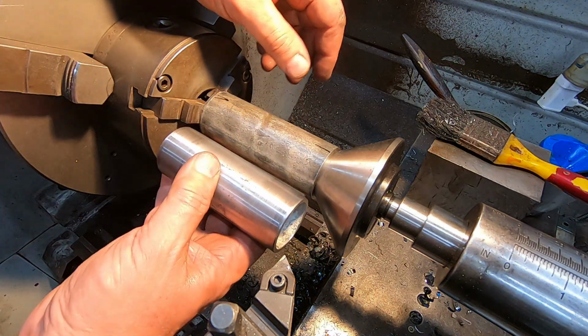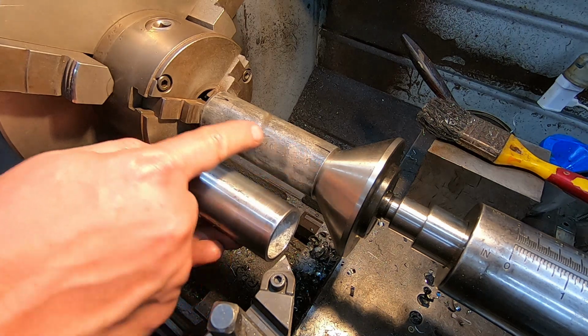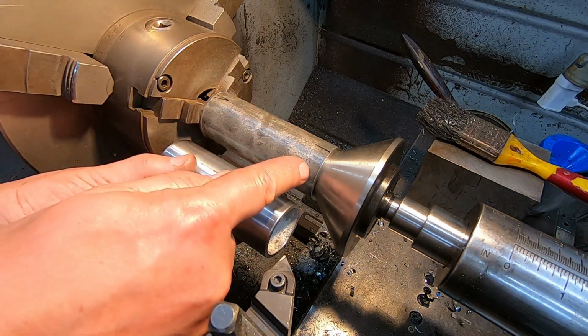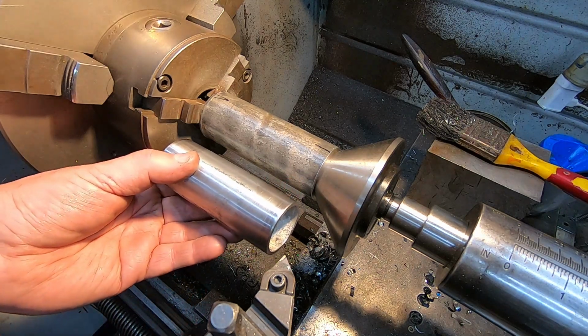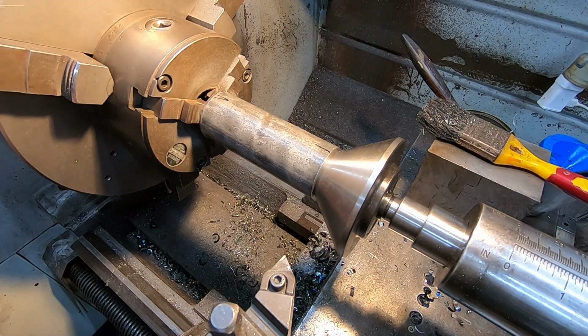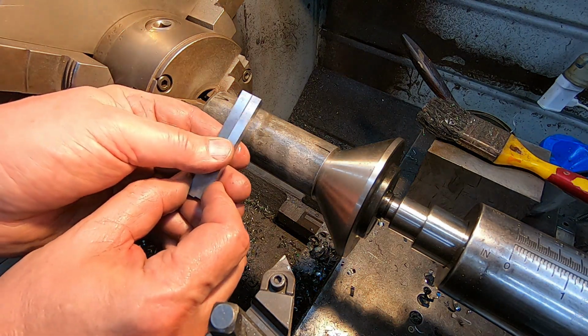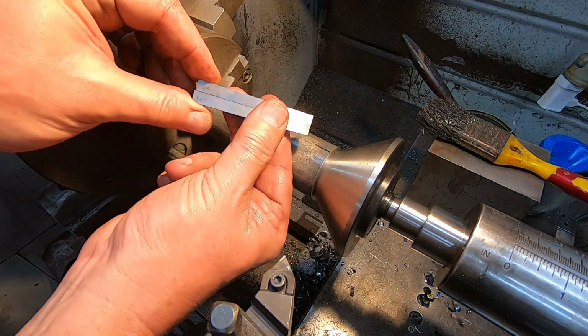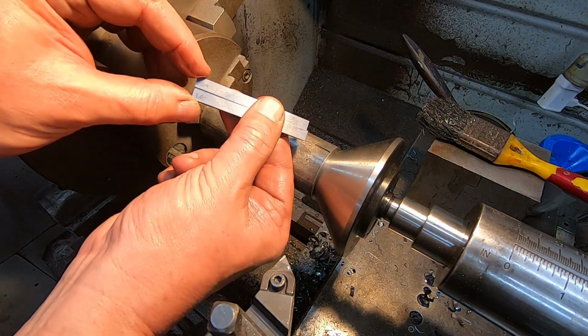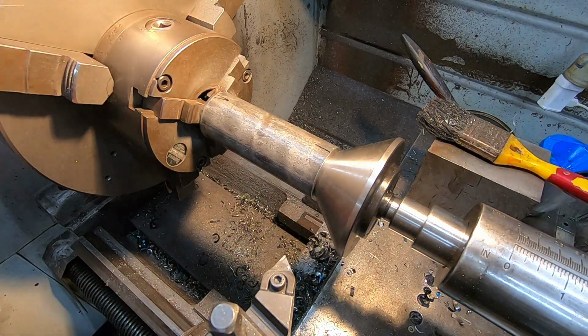So to get this, what I did essentially was divide this into three, it's basically 3/4 of a degree angle on the top slide, and I achieved the 3/4 of a degree using a pair of angle blocks. I don't think you'll be able to read the angle setting on them, but maybe you can. Anyway, so these two together add up to 3/4. It's going to be a case of near enough is good enough.